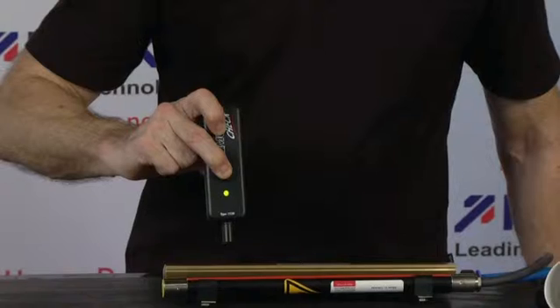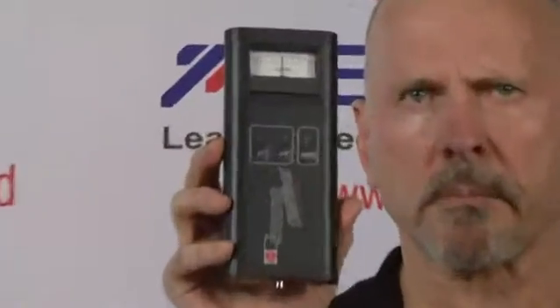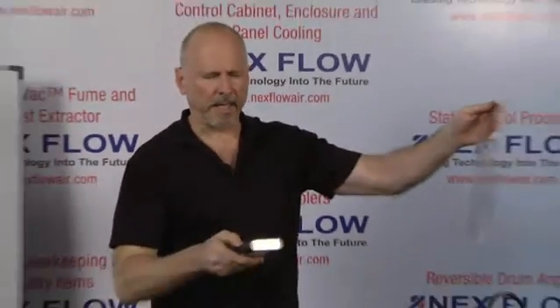That tells you that there's adequate voltage at the pins. There should always be a minimum of about 3,600 volts at the pins to be able to work properly. The second device that you need is the static meter, to measure the charge of the surface before and after, to know that it is actually working. So we have a static meter here, which I will now use to measure the charge on this plastic sample I have in my hands.